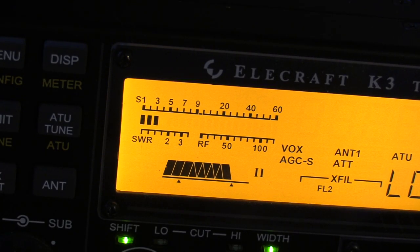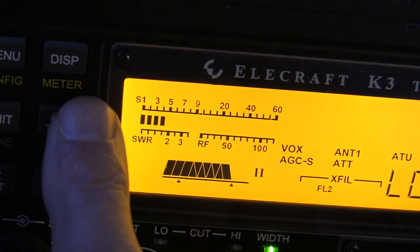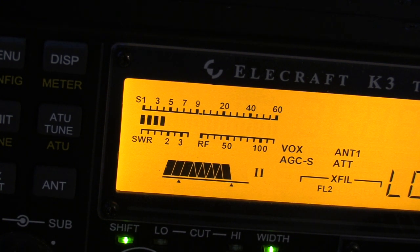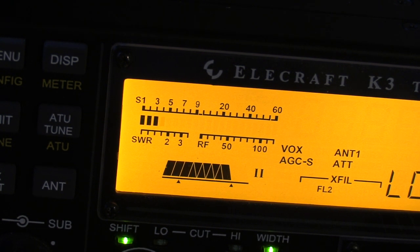Right, we're now on 40 meters and I'm just going to press the auto ATU — that's resonated it or adjusted it. Now on CW you can see 100 watts on the right hand side and hardly any movement on the SWR on the left hand side. I'm now going to bypass the ATU. The ATU now is bypassed, and if I try to tune it nothing will happen because it's bypassed. Now watch the VSWR on the left hand side — there's very little change at all if anything. The VSWR is still about 1.2 to 1 indicated on the panel.